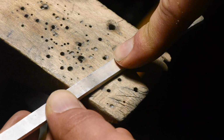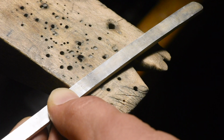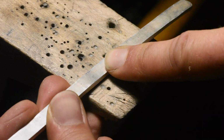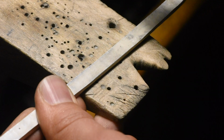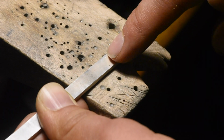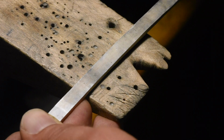I might actually start texturing. I might actually do all of that with the ball peen to just impart the texture now, even though I'd like a delicate texture eventually. I'll only use the ball peen on one side. If I do anything on the other side, it'll be with the flat. Yeah, it's going to be fine. Let's just anneal this one more time and draw it out for the last little bit with the ball peen. I'm learning as I go. Again, I've never made this specific design before. I have made this design with a 1/2 ounce, but the 1/2 ounce works a little differently.